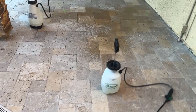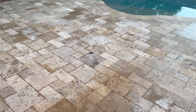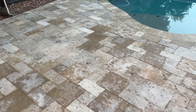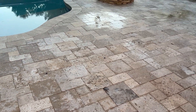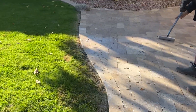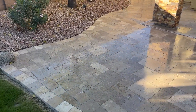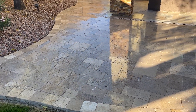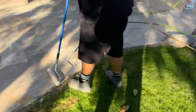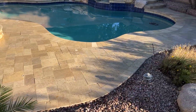A little bit of an interruption, but that's all right — with these types of jobs we really just don't know what we're getting into, so we want to make sure that we get it done right. Now once this is done, we're going to start putting our sealer on after we do the sand. The difference with the sealer we use is it's a urethane-based product. Urethane coatings are very different than a regular sealer, mainly in how durable they are — they're going to last way, way longer. Especially in a climate like we have here in the Phoenix area in Arizona, most sealers really don't work.